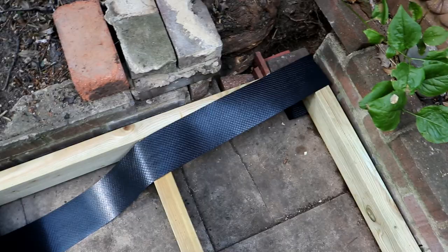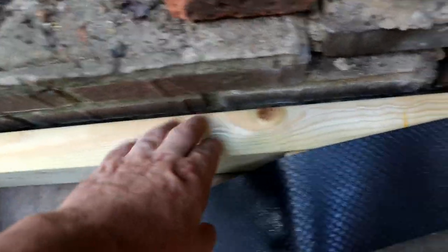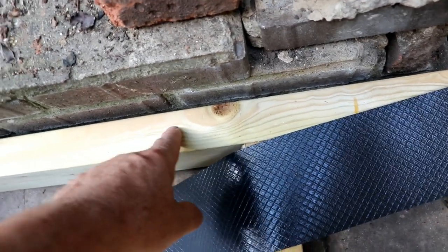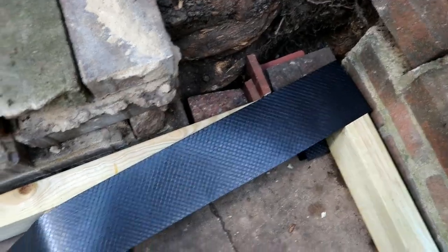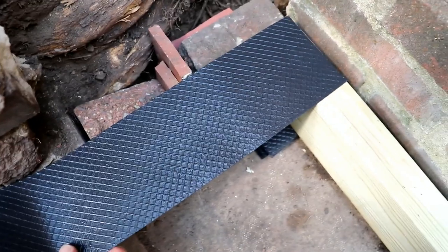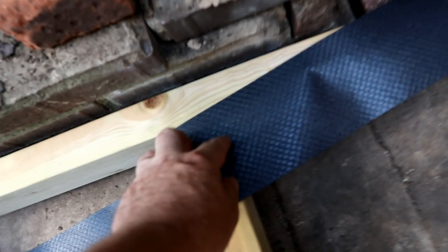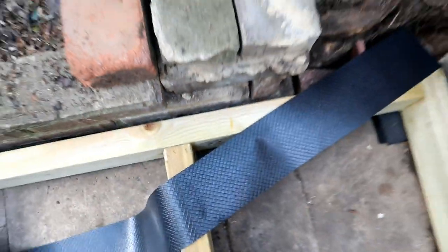Next thing to consider — which has kept me awake for several nights — damping, damp proofing it. Because obviously this is meant to be concrete and then you're meant to have the base of the shed sitting on aluminium U-shape, but there's holes in it and a join in the middle, so water will collect and run out in each corner. So what I'm going to do is staple the membrane — one piece along each side, overlapping on the corner, just hanging over slightly the edge of the wood. This material even has raised criss-crosses, which means any water that does collect can't really move around at all.